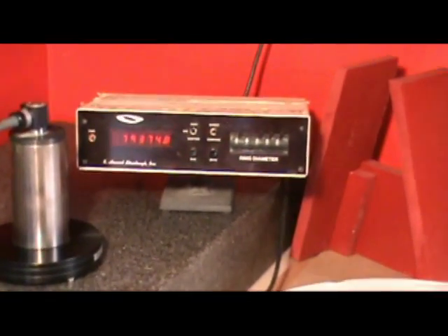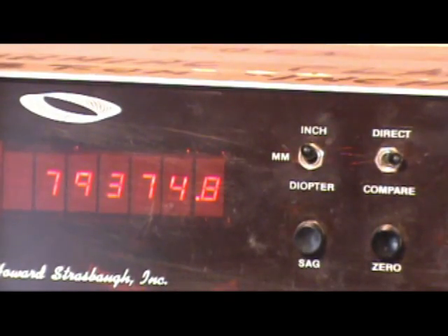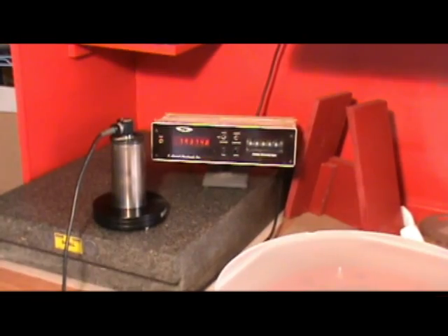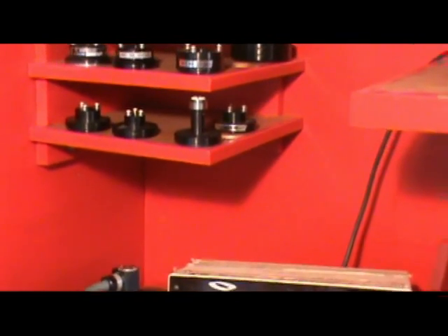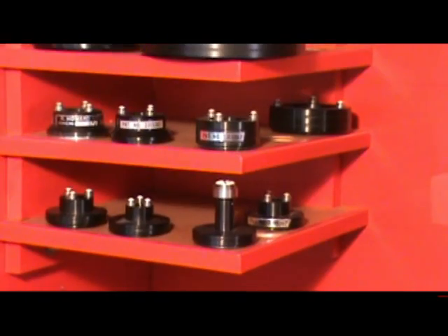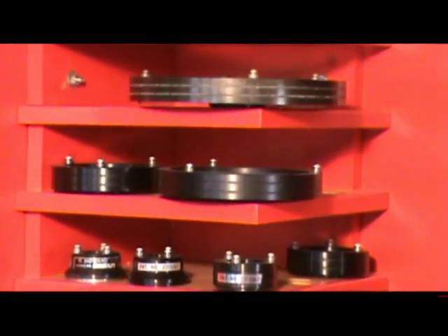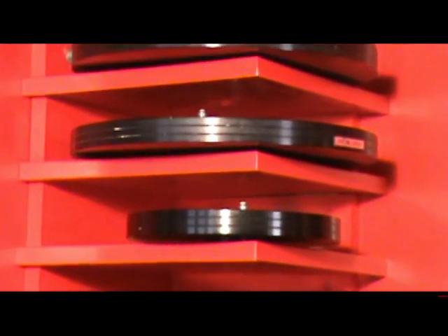Let's take a close-up look at the controls on the spherometer. On the right here, it shows the ring diameter, and you can see there are little buttons to push to zero the spherometer or to check the sagitta. And on the left, you see the actual digital readout of the spherometer. It reads out in inches or millimeters or diopters. I have many different head plates for this spherometer. You can see the bottom row there is all small little plates, each one a different size for the most part, although I have duplicates of some of the more popular sizes. They go up through four and five inches, then up through the eight-inch plates, 12-inch plates, and the very largest one at the top is a 16-inch plate.